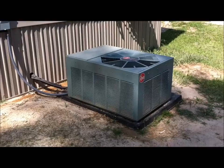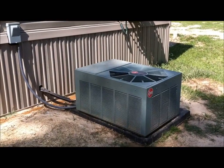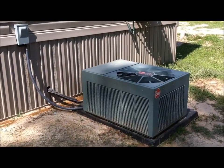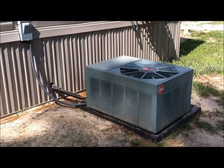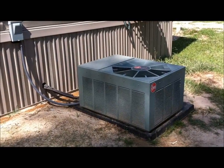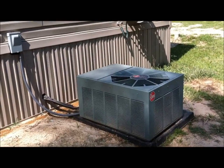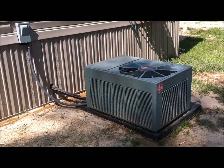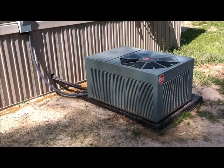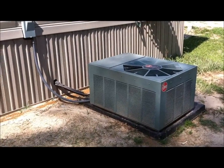I just got myself a Trane heat pump system, an XB13. We know these mobile homes come with the air handlers, but they don't come with the coil. Actually, if you just buy Trane's regular cased coil, like you'd use for a gas setup with a cased evaporator, my Trane rep said their coils are suitable for mobile home use, which is true. Fritz, you'll know this if you sell American Standard: if you look on a coil, it says suitable for mobile home use. So all they told me to do is take the coil out of the casing it comes with from Trane and slide it into the mobile home air handler, and you're good to go.